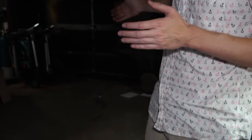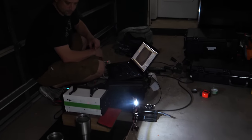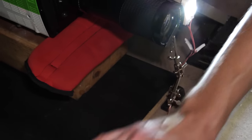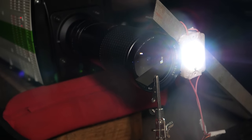So now what we're doing to prove this is going supersonic, we're using a technique called Schlieren Imaging, which basically lets you see disturbances in the air. We have a mirror down there that's focused into the camera. There's a point source light source here — a little tiny LED light that bounces over there, you can see the reflection of the LED. It goes there and into the camera, and it lets you see disturbances in the light.